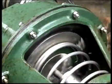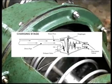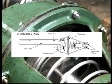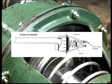The operation of the pump is very simple. Using a flow of water falling as little as 0.5 of a meter, the water flows down the drive tube into the diaphragm chamber and out the exhaust valve. Now the water pressure against the valve slams it shut.